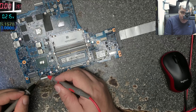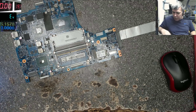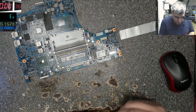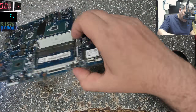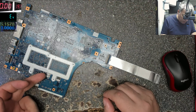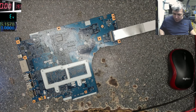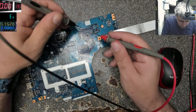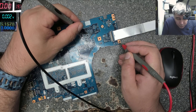Pin number 4, pin number 8 — it's not shorted. So why is it taking the same amount of power? 170 milliamps. Because of the blow of things — one more time. Let's check. The output of this chip is short to ground, so 3.3 volts is shorted.